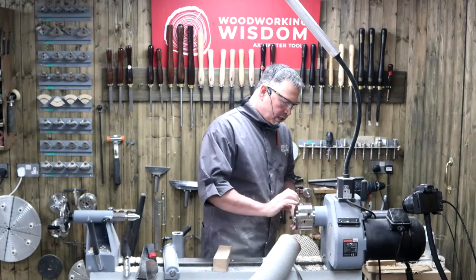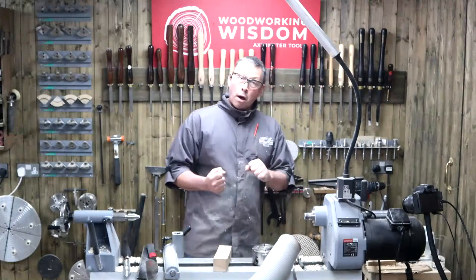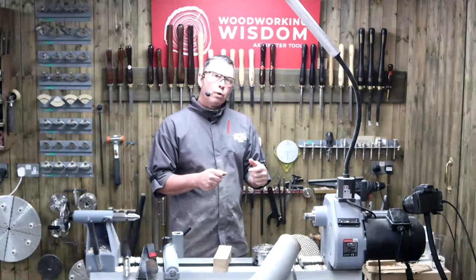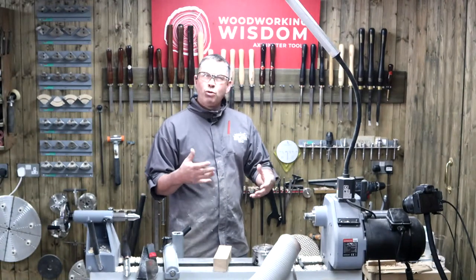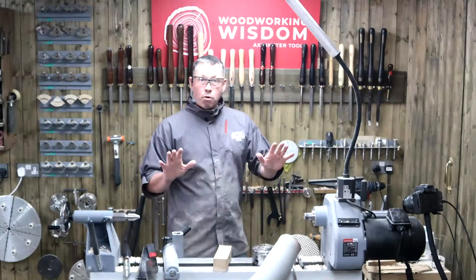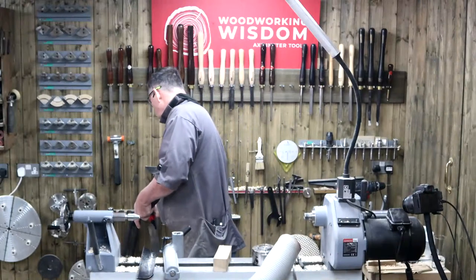The reason that hickory and ash is used is because it's strong, but it's pliable. So there's some give in it. It handles the stress of being levered. I'm not sure whether the hornbeam might be a bit brittle. So there's no give in hornbeam. Whether it might snap easily, especially after a few years. I might be wrong, but I just feel that because it's so dense, I'm not sure it's ideal.